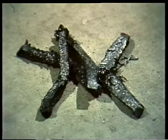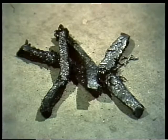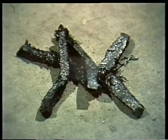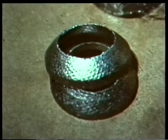Once in a while, pre-cut packing is broken or cracked and can't be used, so be sure to look it over before using it. If the rings are arranged in a particular order, be sure to keep them in that order. Some valves may require more than one type or shape of packing. When there is more than one type, the rings are packed in a specific order. By keeping them in that order, you'll put them into the valve in the proper order.